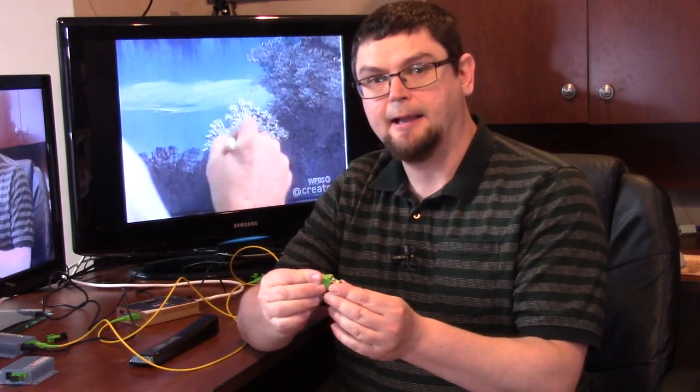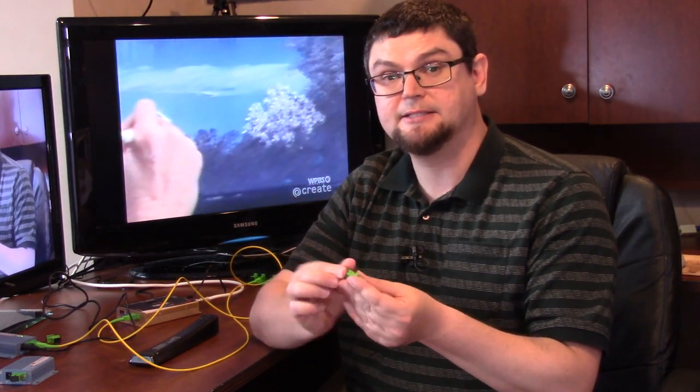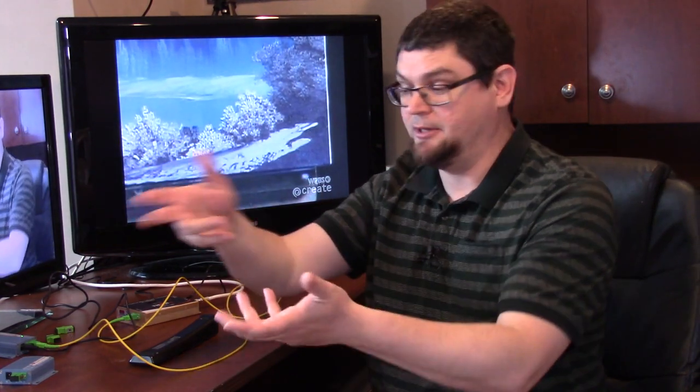So if you're looking for a solution for this, I highly recommend checking this one out. There are some more things to buy, but if you've got, say, 40 to 60, 100 people in a building and you want to distribute your own private master antenna system, which apartment buildings and multi-home dwellings really should do because cable is so expensive. A building can just put up its own antenna and run its own antenna system, and then mix in a few of its own channels. You can even mix in your security video camera at the door of the apartment building and have a channel on the TV where you can monitor the entry to the building. Old analog cable systems used to have that all the time, so we should have that with digital. With a Thor modulator, you could do that.